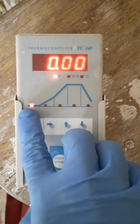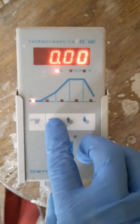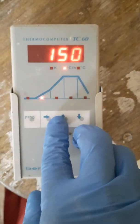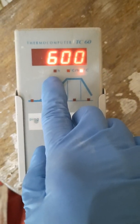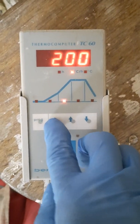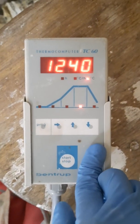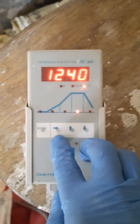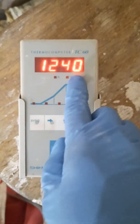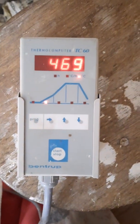The next button press will be delay — if you would like delay you press it, if not just press that button. Press that button again — that's 150 degrees per hour for the first ramp, going up to 600 degrees. That will take about four hours to reach 600 degrees. The second ramp — press that button again — is 200 degrees per hour, and press that button again — 1240 is the maximum temperature. So from 600 degrees it will jump up at 200 degrees per hour until it reaches the top temperature of 1240, plus 15 minutes soaking. Then skip again, and that's it.